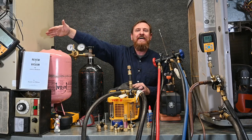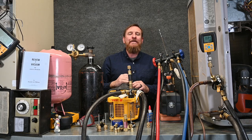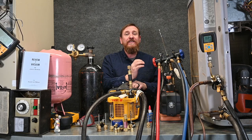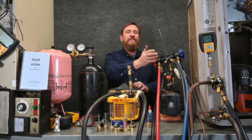The micron gauge should be as far away from the pump as possible and as close to the system as possible. Ideally, we'd put it over at our evaporator coil far, far away so that we can see it. I do recommend some of the newer micron gauges — MeasureQuick has some that work with its app so you can actually record and save your microns as you pull a vacuum and prove to somebody else that the system is clean, dry, and tight.